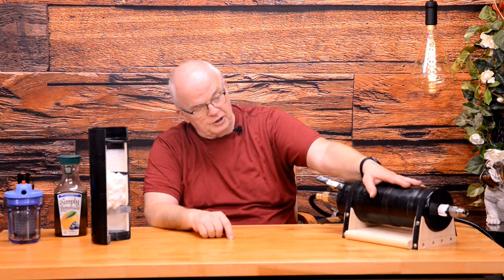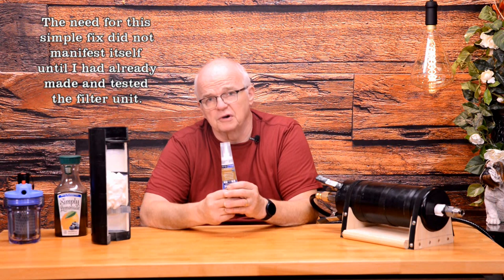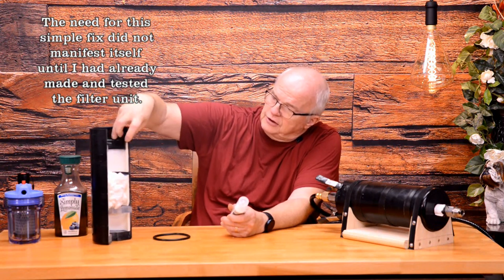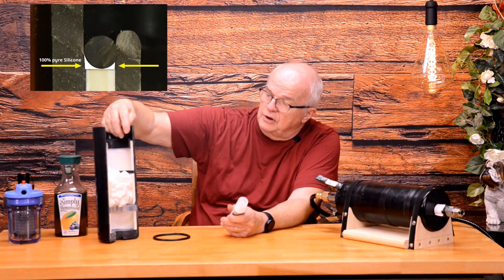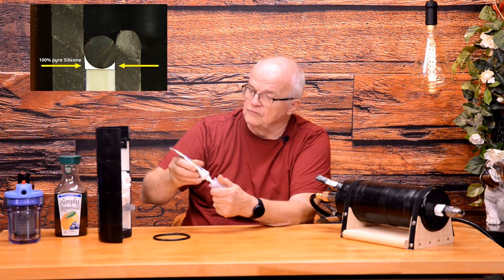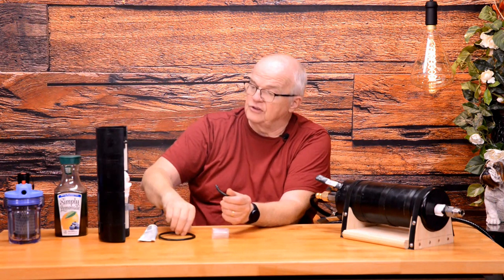If you're interested in making one of these, they're not expensive — you'll spend about $100, maybe $120 in parts. In video two, I lay out all the parts and tell you exactly what you need. One additional thing I'll mention as an update: you're also going to need 100% pure silicone. After you make the unit, I found there is a chance it will leak around the O-ring in the channel. The fix is easy — just take some silicone, put a little bead down into the bottom of the channel all the way around, and set the O-ring down into it.